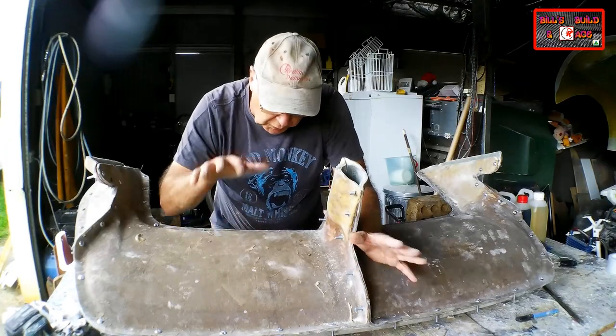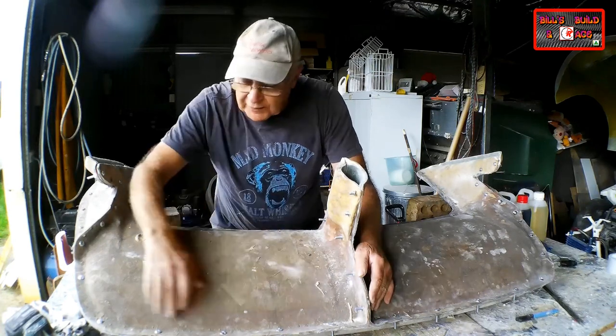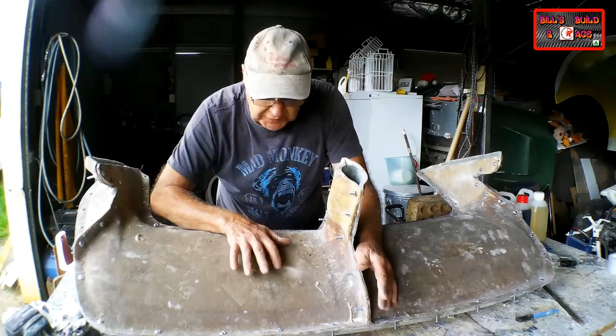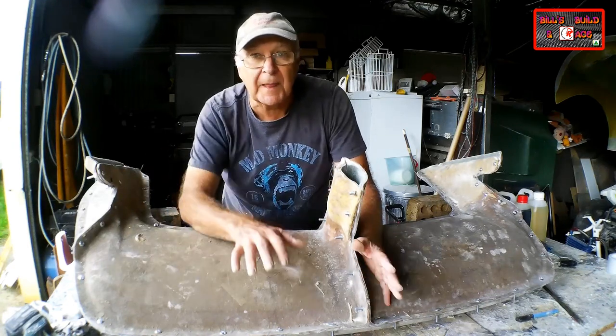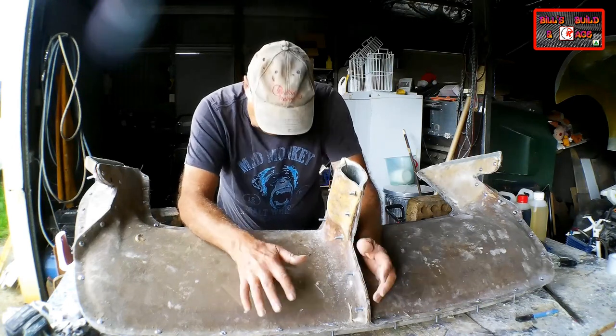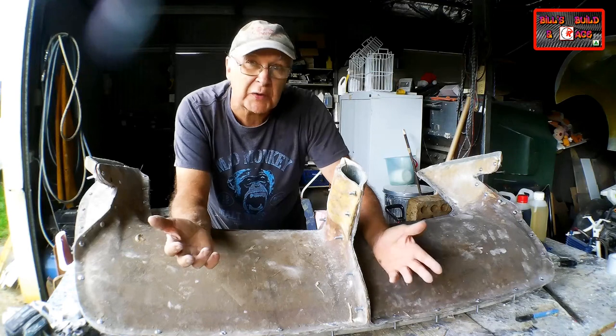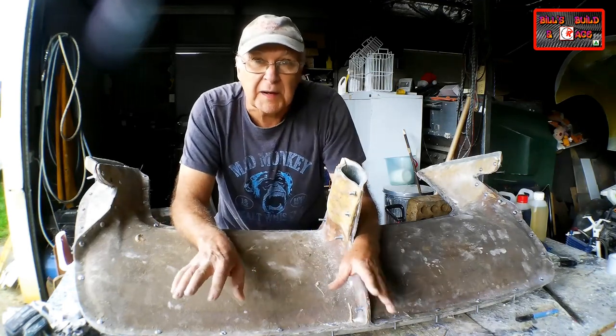Pouring foam will glue these pieces together way more strongly than you could ever do with edge gluing, because the foam adheres to the whole surface of all the pieces. It's light as well as being incredibly strong, so the weight is of no consequence whatsoever. You've got to be careful when you're pouring this.